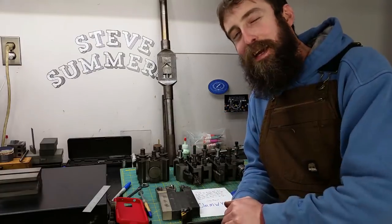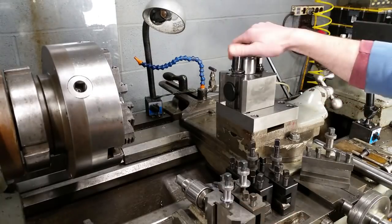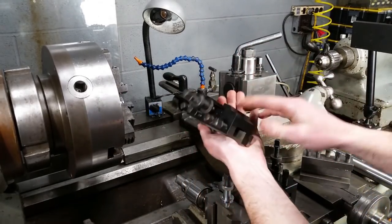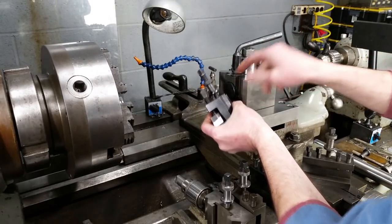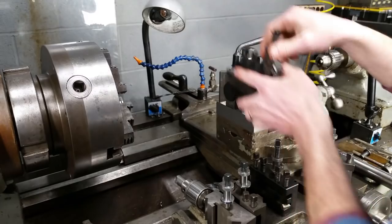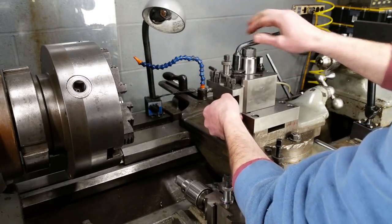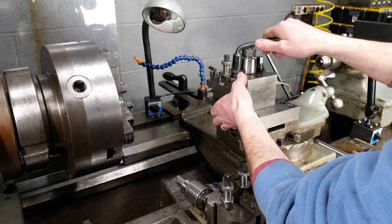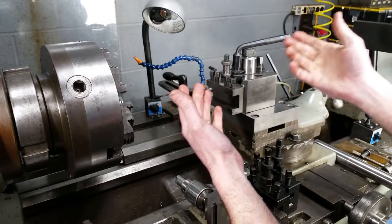So enough gabbing, let's go over to the lathe. We will get set up and get started. Here is our tool post that we changed recently - we went from a four-way to a quick change. Here is one of my holders that I got with the quick change. When it slides on, it registers the nut here on our stop really well. It gives us plenty of room, we can come in here and adjust this and it's smooth and easy. Now here is one of the original tool holders that Adam sent, and it fits on here but almost slides completely past and our handle runs into the nut. We can get it to sit on there but it's really rough because it's just rubbing on the very edge. Hard to adjust and not acceptable, really. I'm going to have to make some new ones.